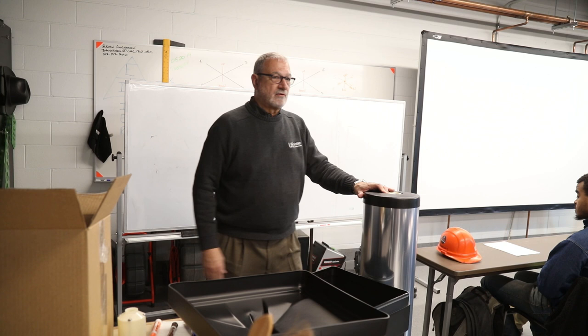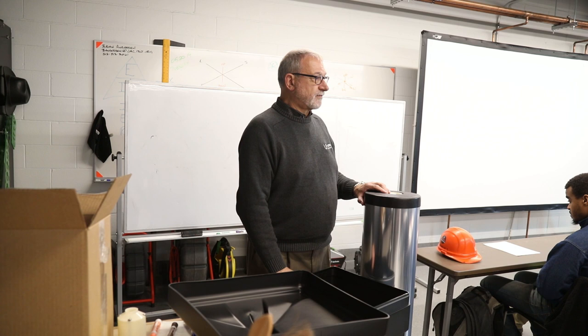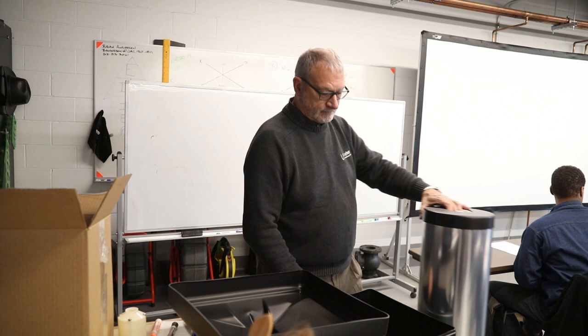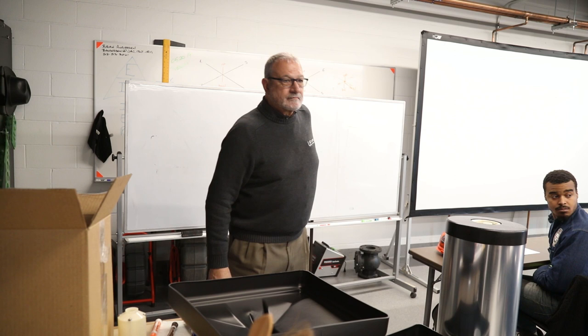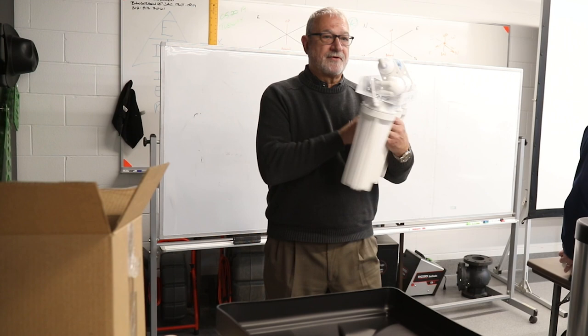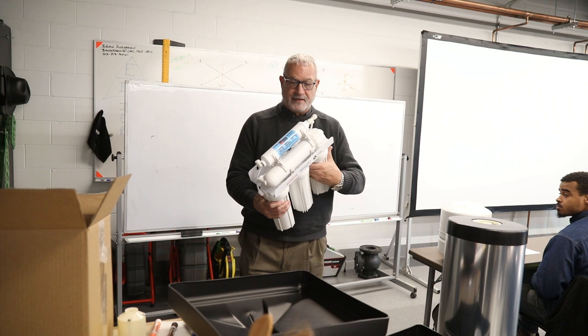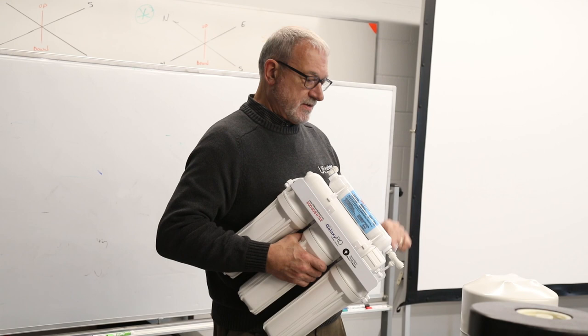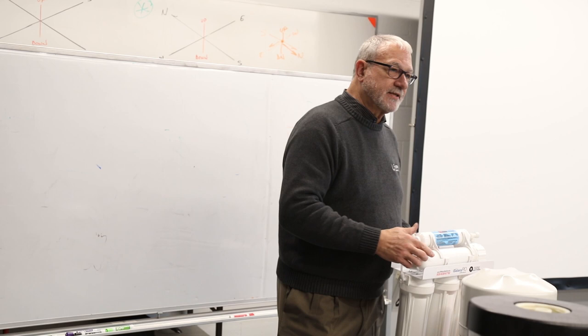You may not like the taste of softened water — I don't. So for water that's softened, or water of unknown quality, this is an under-sink reverse osmosis system. It's really not difficult — has anybody here ever installed one? It's a quarter-inch feed, quarter-inch to the drain, three-eighths to the tank, and three-eighths to the faucet. This is a pressure tank rated at four and a half gallons, though it probably holds a little over two gallons in the real world because it's got a bladder in it. At any given time you're going to have about two to two and a half gallons of water on tap.